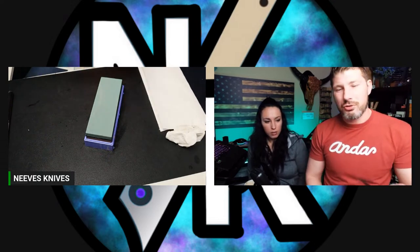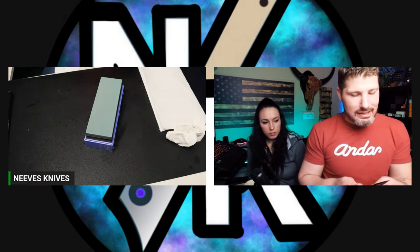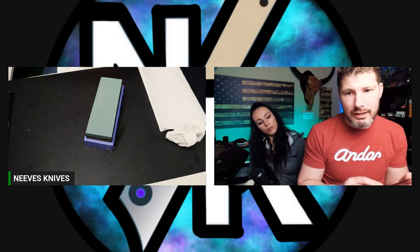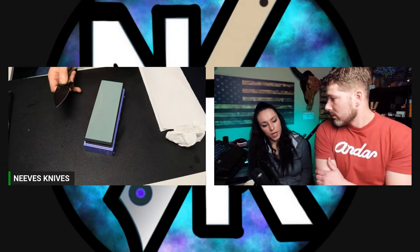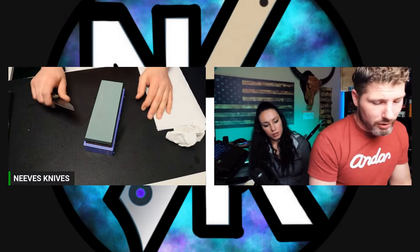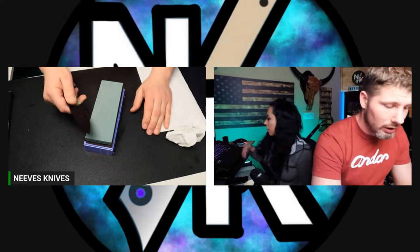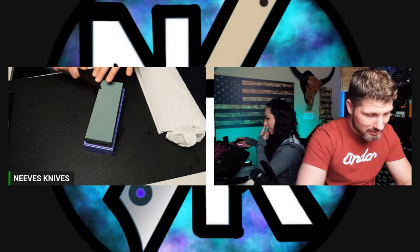I would normally do between a 15 and a 17 degree edge bevel, but it's not the thinnest behind the edge, and 20 degrees is going to reprofile it already. It started out with somewhat of a high angle, probably about 25 degrees. So I'm still going to be reprofiling, and then in the future, I can always drop it back down. I guess a knife like that, you wouldn't be using for tasks that you really need like a 15. Well, it would make it a lot sharper. But the thing is, it would take me so much longer to do a 15 degree bevel, and it'll take me less time to do a 20, especially since I'm not using diamonds, right?